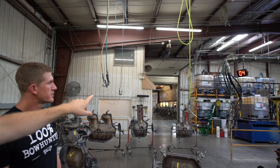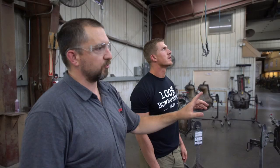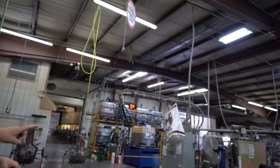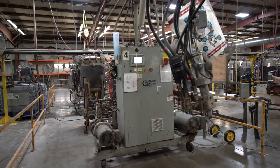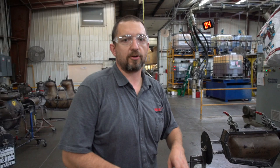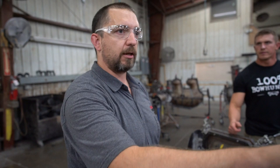This is so cool. So we have two foam systems in-house here. If you look up there, you can see our rack where all of our raw materials are coming in. And there's some piping up in the air, and so it feeds into the four machines behind us here. Each machine through the pipes in the ceiling, and they come down. Each machine carries either a different color or a different type of foam. So this machine here is our Duraflex foam in black. And across from it over there is our brown Duraflex foam. And then down here we have our Lowflex with brown and black. So depending on what we're running that day, we can do black, brown, our backyard pro stuff. We have the ability to do any target we want.